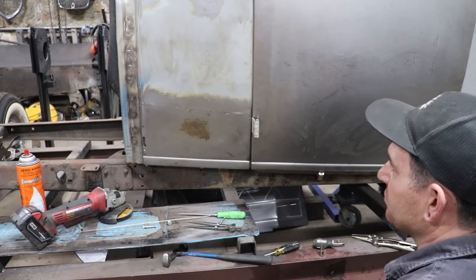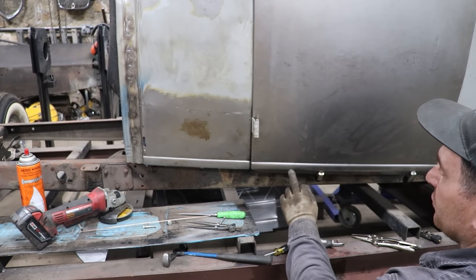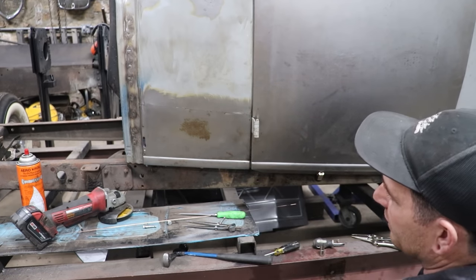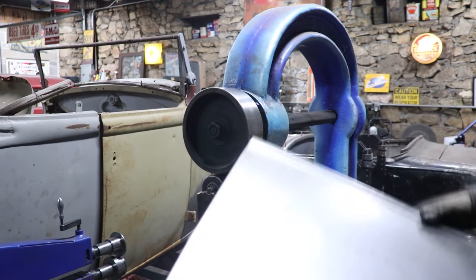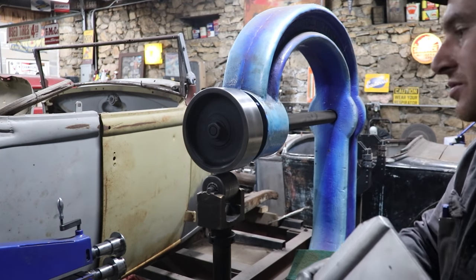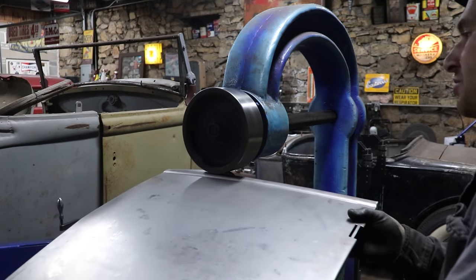Even though I consulted with Aaron and he said it was just fine to leave the beads off, it hurts my OCD a little bit. So I'm going to try and move this bend down a little bit. I'm going to take this off, actually run this through the English wheel to take out this bend and try and smooth it. And then I'll mark my bend line on both sides the same, put it in the brake, break that edge and that should get us a little closer. So I have a flat lower wheel and a flat upper wheel on here, basically just planishing, running this through just to take this hard line out that they started.